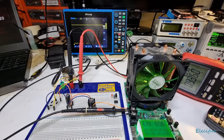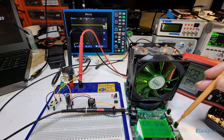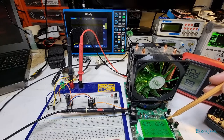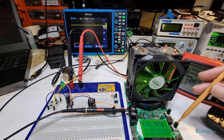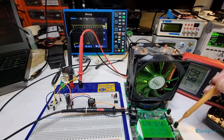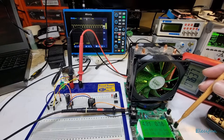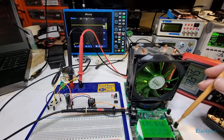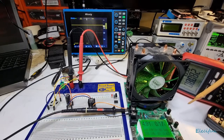Now let's tweak the load up a little bit more. We've got 9.3 volts on the AC side. At 220 milliamps it starts to break down, so let's back off to 150 milliamps — we still have a nice clean DC line. Pushing it a little more, that extra 30 milliamps pushes us back into horrible-looking DC. Backing off to about 130–150 milliamps... 170 milliamps looks like the top, because at 180 milliamps we drop out, down to around 8 volts, which is probably the lowest you'd want.